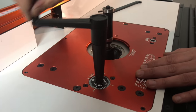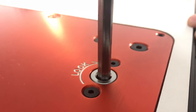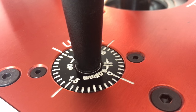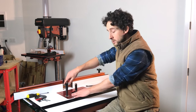You're raising and lowering the router body through the top as in the previous one, but you can also lock off the height through the top rather than reaching around the table — so that's one advantage. You've got your turning stick, which is actually turning this new lifting mechanism, not the turning screw on your router. And then you've got a little locking hex nut here that locks off the height. So once you've changed your router bit, adjusting the height is simple — it's all done through the top. A second advantage is you can use any router you like. Third advantage is you have really high accuracy, potentially more than you would get by using the turning screw on your router.